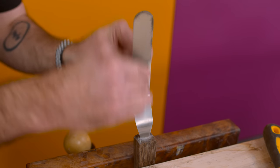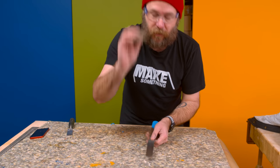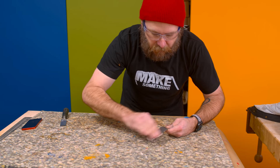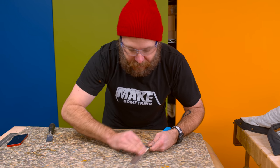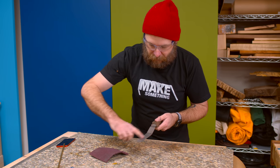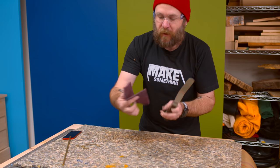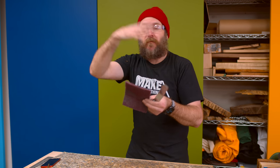For some reason, the stainless steel only had the protective coating on one side. So on this other side, I'm going to introduce the scratch pattern into there, just with some sandpaper. And then once we get that scratch pattern in there, we can take the abrasive pad and polish. So that's looking pretty good. No sharp edges on there. And I like the way that polished up really nice. Got the bottom looking like the top, and just using these red Scotch-Brite pads, they go up to a finer grit. So the finer that you go, the more of a mirror-like finish you're going to get on there.